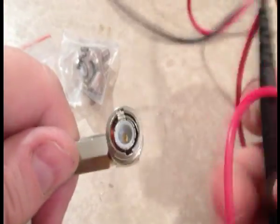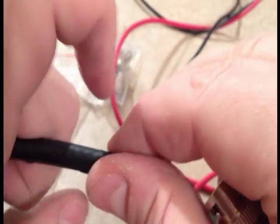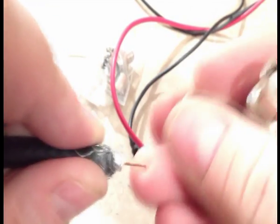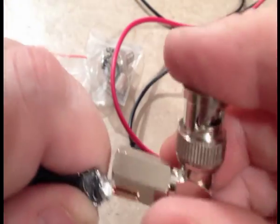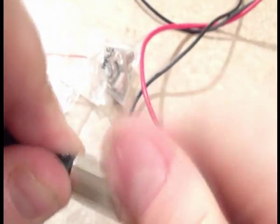These connectors are reusable. So if you ever decide you don't need a wire afterwards, or maybe you want to replace it with twist-on F connectors, you just unscrew them and put on your twist-on F connector, or, if you want a hex crimp, it slides over the wires and then you crimp it down. You can get the kind with threads on like this, twist-on F connectors going the same way that this does. You just place the hole like this, and you just twist it on.